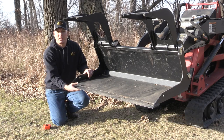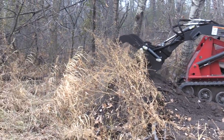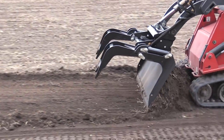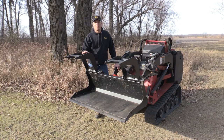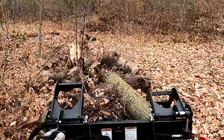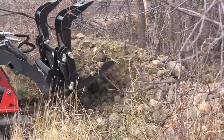The second cutting edge is nice if you're in an environment that has a lot of abrasion like scraping on concrete. It also adds some extra rigidity to the front of the cutting edge. One of the points I want to make about this grapple bucket is that it operates just like a regular bucket and gives you an extra dimension when you have the grapples on it. Yesterday during testing we showed cutting into dirt and grading, back dragging — it operates just like any other dirt bucket. That's really nice if you're working in landscaping, construction, or demolition.